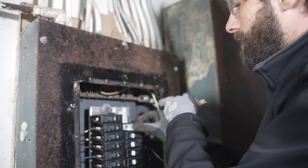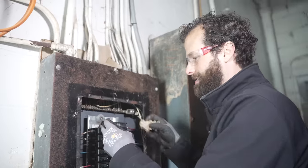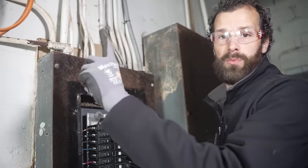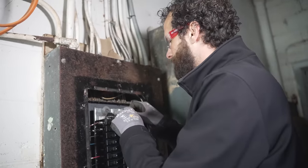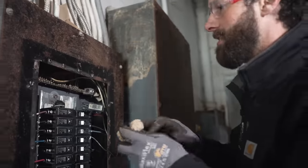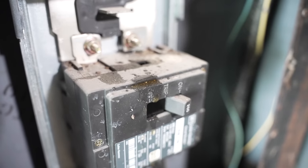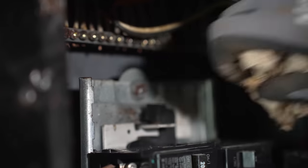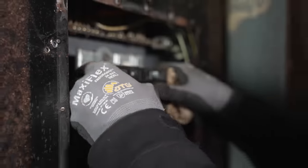Well, that's good. So our scope of work on the bigger project, the $26,000 job, ugh, that smell, is gonna be from here onward. And this disconnect is still off. It's kind of just crud in there. A bunch of mouse poo too. Something to note. Tighten that up. So all this will get thoroughly addressed as we pull new circuits and home runs.